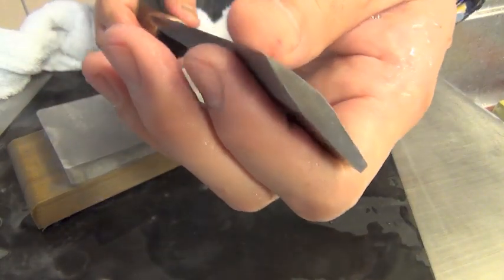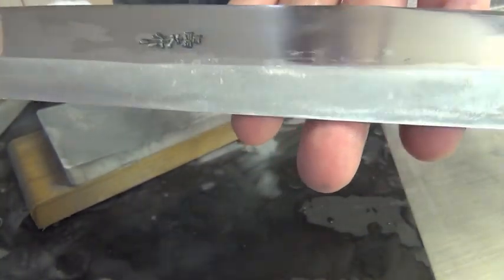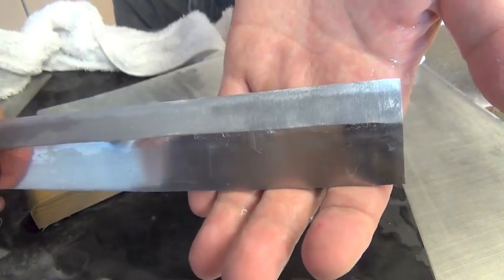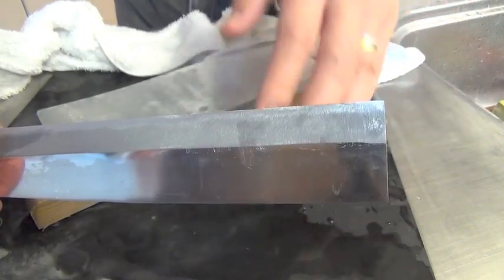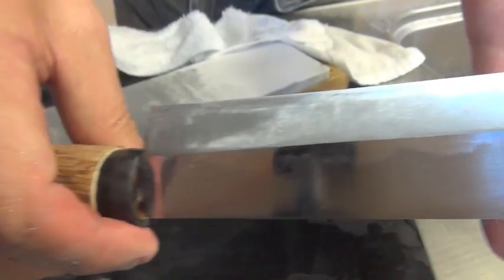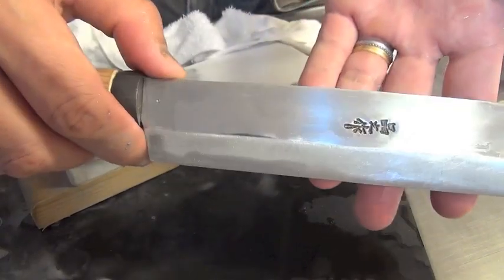I hope you can see this edge angle smallness compared to the initial condition. You can see the real lamination line. This line marks the coating line — I guess the coating was done using the same technique as increasing the Damascus lines. Anyway, this lamination line is proof of the construction. The core is blue paper steel, parallel to A2 in my opinion.